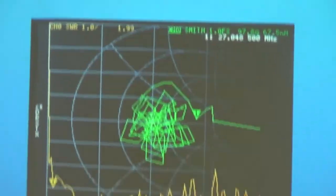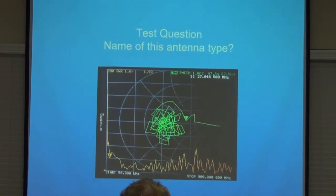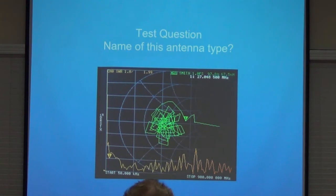I told you there was a test. Let's do the test first. This is a chart of an antenna looking in on a single port, showing SWR from 50 kilohertz to 900 megahertz. It's almost less than 2:1 all the way across except for a few little irregularities, and the Smith chart is right in the middle — the impedance stays close to 50 ohms as you run around it. Disc cone! Correct — it's a disc cone with a CB vertical on it. The notion of what you can do with this chart — backing into what kind of antenna you've got it plugged into — it's that rich in terms of its information.